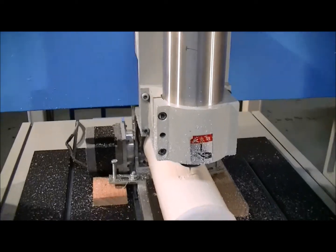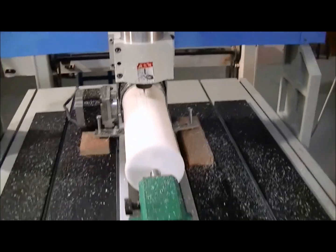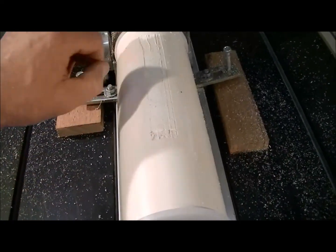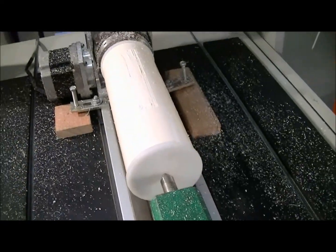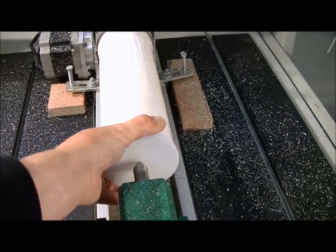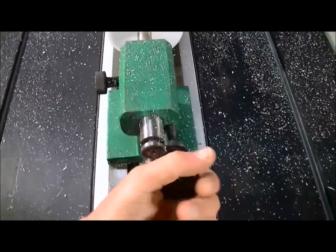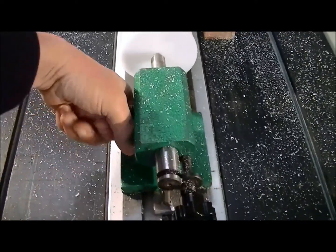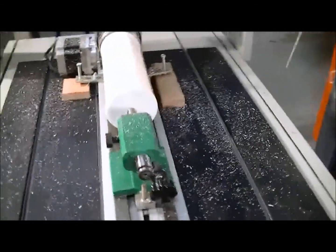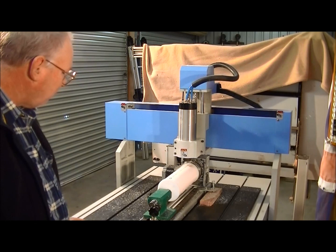What I think has happened is the tube must have... I've just done it. You can see the result here that I was not happy with. I've dropped the clanger — it's my fault. The tube is actually loose on here; I hadn't tightened this up enough. So just a matter of tightening the tail stock up and locking that. It becomes firm. Sorry machine, it was my fault. We'll put a new piece in — that just goes to show that we all have stuff-ups. Hopefully I don't get any more.